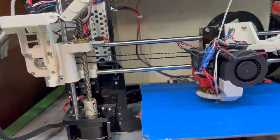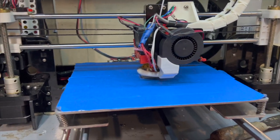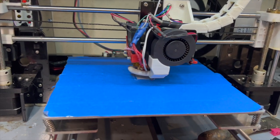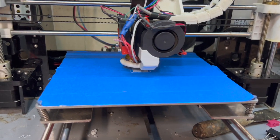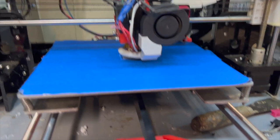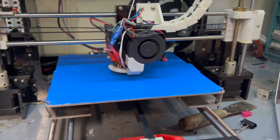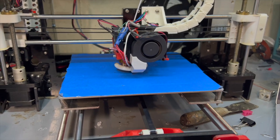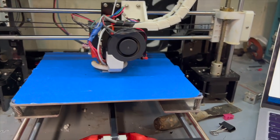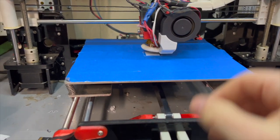It is very similar to an Ender, so that does help, but then again, you can really use any board on any printer as long as you have the correct firmware. So I went with this board because I'd gone through two of the stock Anet boards. Some of you might know there is a capacitor in them, I believe C43, which controls your bed temperature sensor, and those are known to kind of just burn themselves out. And stock Anet boards are like $80, and for a printer that I bought for right around $100 a couple years ago, I think that's just awful.